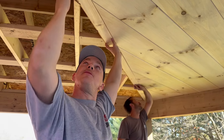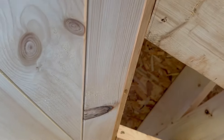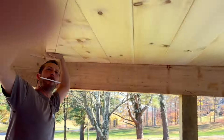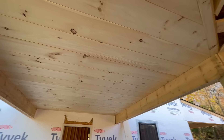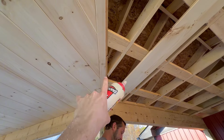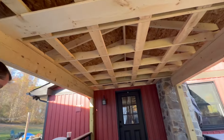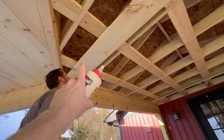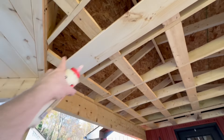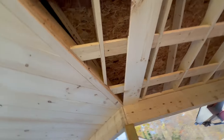Now you can see when snapping this piece up it's all flush with the same bevel — matching each board. Now that this side is complete, to continue the pattern and make all the seams line up, we first go through the full piece, measure back to the house, make sure everything's square, then work back from there. We're adding a spline in the female end of the wood so we can turn the boards and work in the other direction.